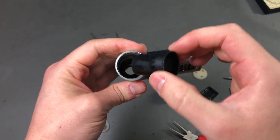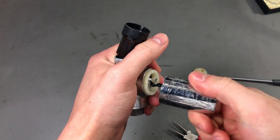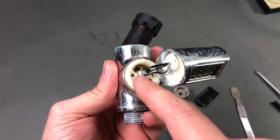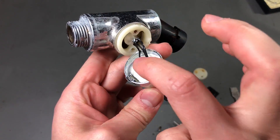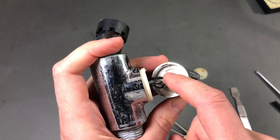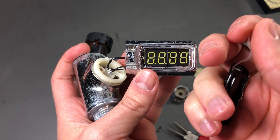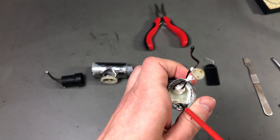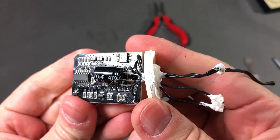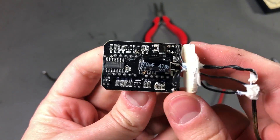There doesn't appear to be any more to disassemble on this side, so I just have to pull on this — and it comes apart. There is some silicone sealing the port that brings the thermocouple and turbine wires back to the main body, and also some silicone inside here. So really there is no other way for water to get in unless some of these seals fail or through the screen protector which had a very thin silicone seal. The final bit that needs to come out is this seal cover here — and actually this looks clean inside.